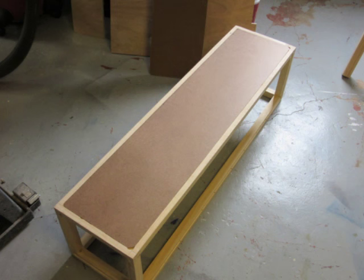The technique that I use to fit each piece of masonite that will be inlaid into the case is to first remember that no part of the stringer structure is going to be absolutely straight. There's always going to be small variations. It's not going to be absolutely square. So what we're doing is a custom fit of each panel. And I start out with one side, the long side usually, of a piece of masonite cut so that it'll line up with one inlay on one long stringer. And then the other three dimensions, or the two short ends and the other long end, are cut to be maybe a half inch or so bigger.